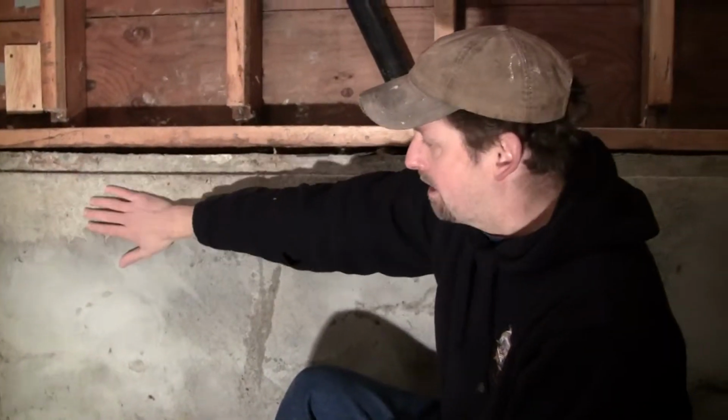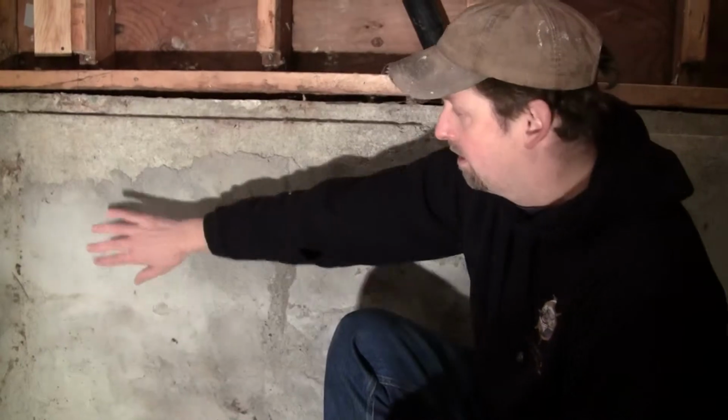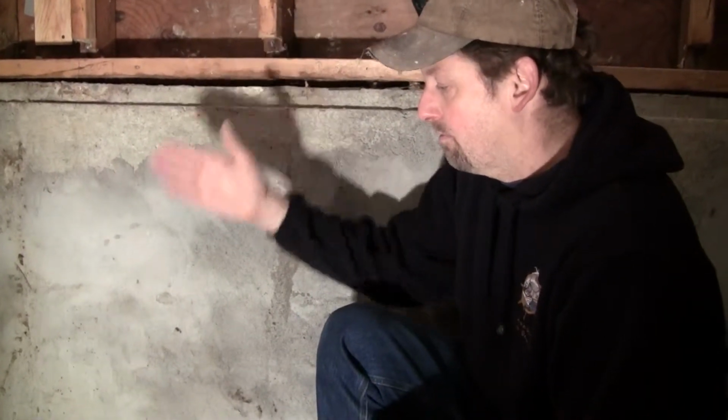And rebuilding it properly means a rigid styrofoam insulation on the concrete with 1/4-inch air gaps, and this will be the same for the floor. It'll be 1-inch styrofoam on the floor, and 1.5 or 2-inch styrofoam on the walls with spray foam in the gaps and all the seams sealed. Then you can frame something externally from that and insulate that with standard insulation, or we're going to use rock wool, which is mine tailings, doesn't harbor mold, mites, mildew, things like that.